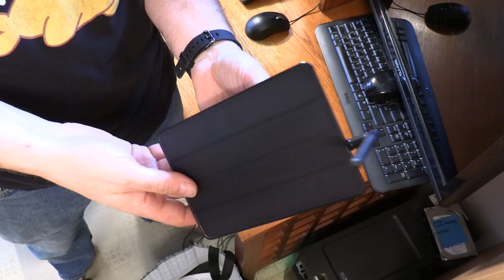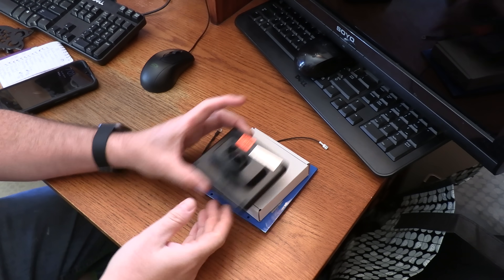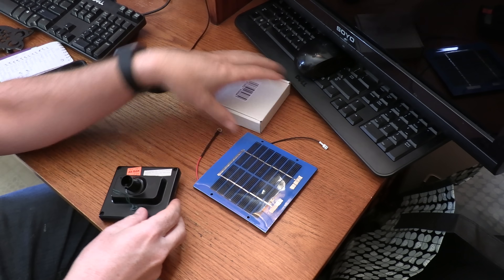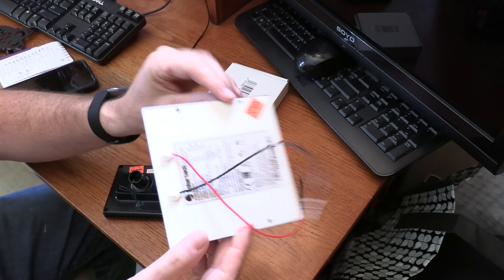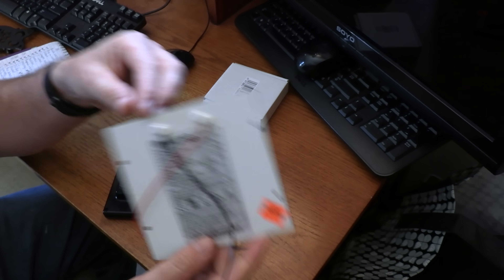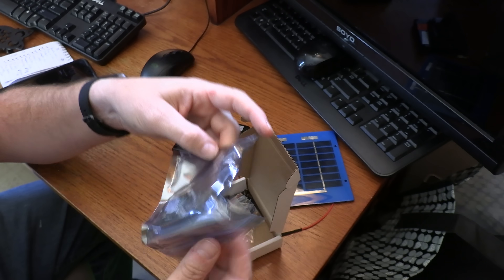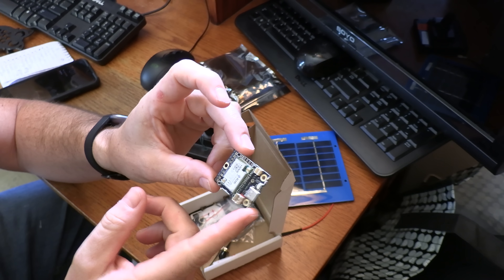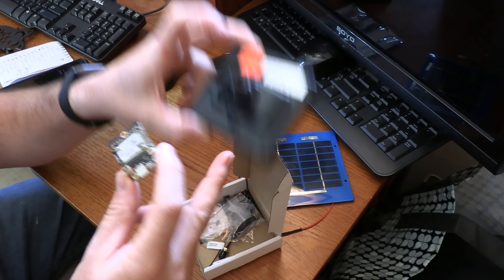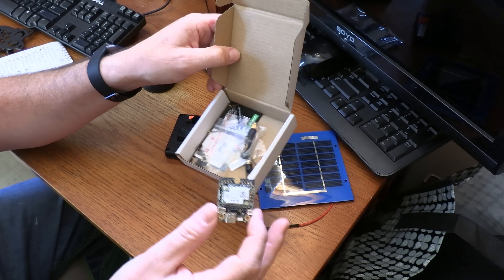I'm just going to leave this outside and see if it keeps working overnight. I'm still looking for a cheaper option for a droppable breadcrumb node. I went to Axeman Surplus and got a couple of solar panels — one is from a little garden light and was just 75 cents, and the other is a more substantial panel that looks like it'll do one watt at about 6 volts, so that one was five bucks. I also got a RAK WisBlock on Amazon. It's tiny and I think these are supposed to be pretty low power draw, so I'm wondering if I can stick this inside a little enclosure with a solar panel and have a really tiny solar node.